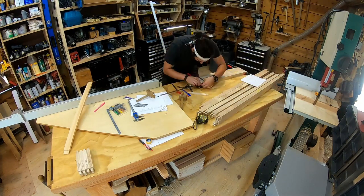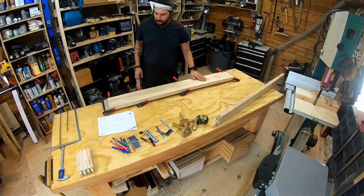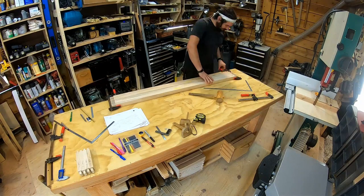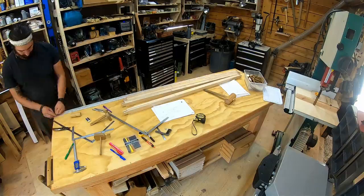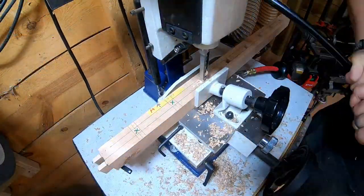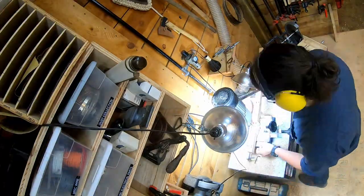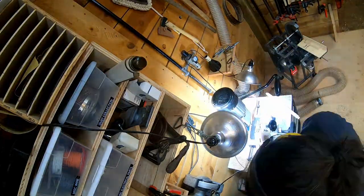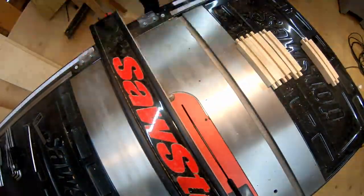Let's talk about the process I used to make these two pieces of furniture, which can be generalized to many different types of furniture. This is basically a frame and panel construction, as opposed to solid wood construction where you'd create large planks joined with dovetails. I designed all this in CAD, created a framework joined with mortise and tenon, and the spaces between the frames are filled in with either solid wood panels, drawers, or — in the case of the changing table back — tongue and groove wood panels.